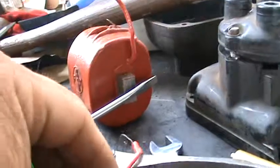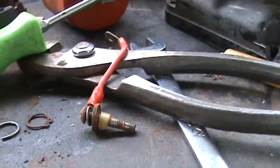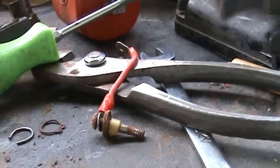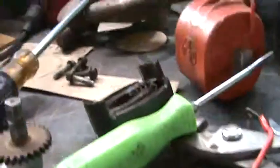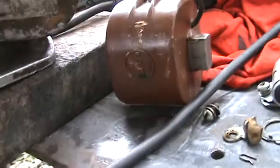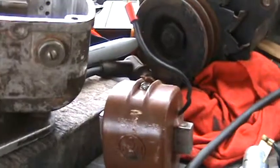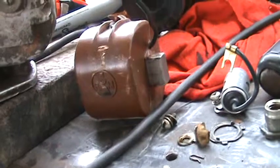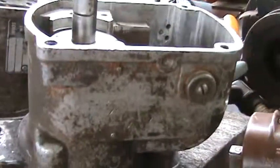A cracked or frayed insulator can cause your magneto not to fire. Same thing on the distributor on the Chevrolet or the Jeep — a little old wire that's caused a lot of problems on tractors. These magnetos create their own fire. When I was putting this coil down inside that housing just to check it, I got bit — just sliding it down in there, it lit me up. Not bad, but I did feel it.